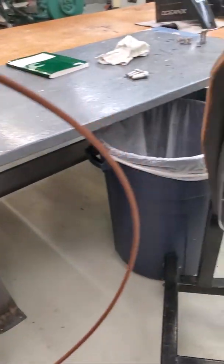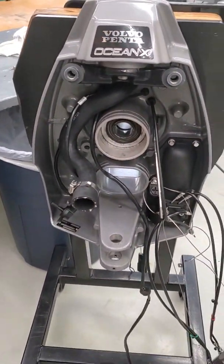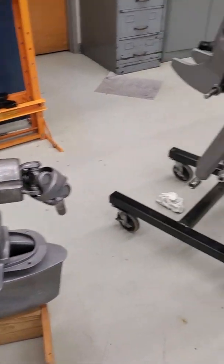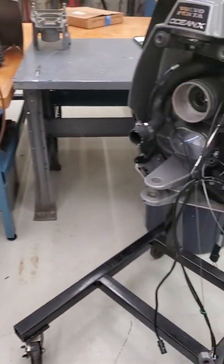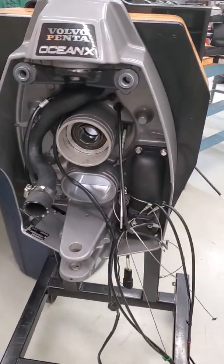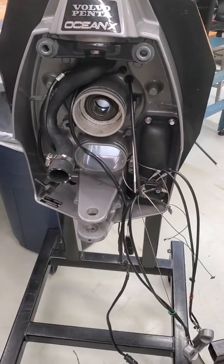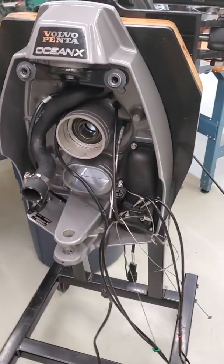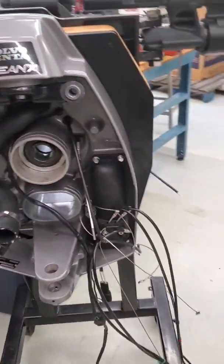Going by the book, they've taken this one apart. They're working on also a more modern OceanX drive — this is the DPSA and DPSB version. So older versions of the stern drive with the trim pump inside, and then the more modern ones we're working on here, where they're going to learn how to change the trim pump assembly, which is integral to the transom assembly. All the way down to pulling out gimbal bearings, replacing gimbal bearings, shift cables, and bellows.